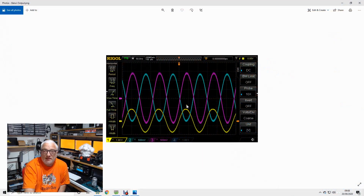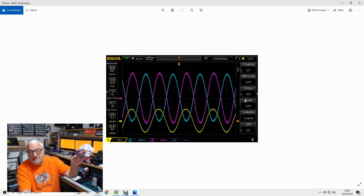The first thing I wanted to show you is the balun output. This yellow trace here is my input signal, and the blue, green and purple are my two output signals. You'll see that they are exactly 180 degrees out of phase — exactly what we want the balun to do. That's critical, and this is true right across the HF range in my balun design. It uses a type 31 ferrite and very tightly wound bifilar windings made with Teflon coated cable to make it heat proof.